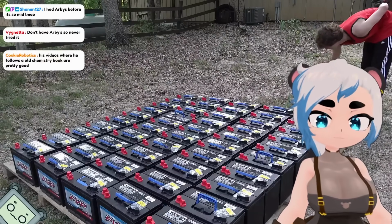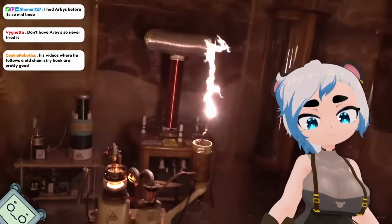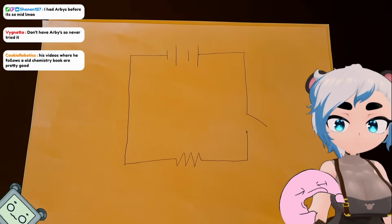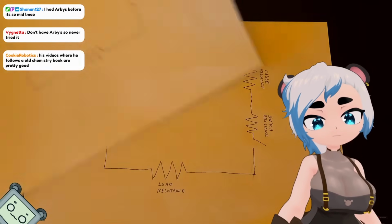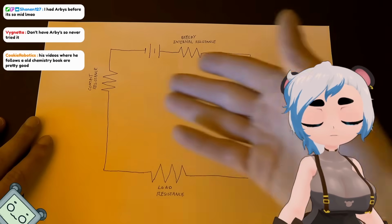As a whole, the engineering for this project was deceivingly complicated. My channel has a history of circuits that operate much more complex than the schematic would lead you to believe, and this one takes the cake for that. I mean, it's basically the first circuit you had seen in Electronics 101 class, just a battery, switch, and resistor. Now, of course, there's a lot more resistances in reality. The cables have a resistance, the switch has a resistance, there's contact resistance.